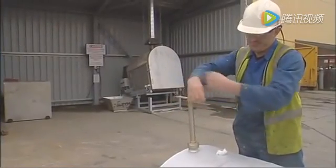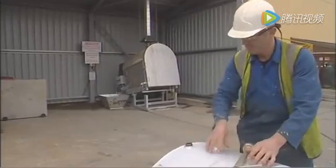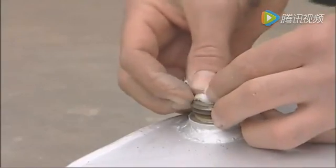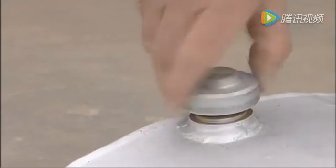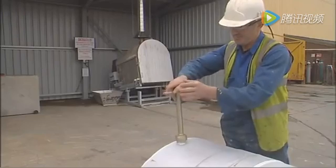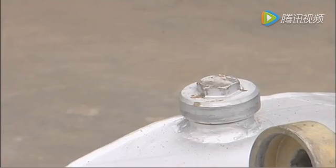This is the melting drum and the first job is to close off the cast hole with thermal insulation fiber. Push the fiber in and check that the seal is tight and check that it's not going to fall into the drum. Carefully screw on the security cap and tighten it. Never use this cap without the fiber plug or it'll leak.